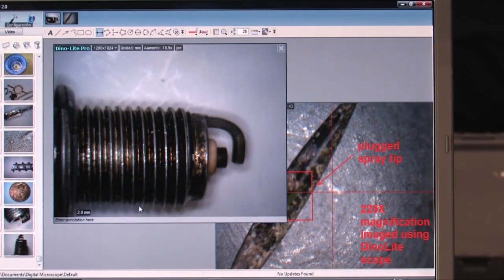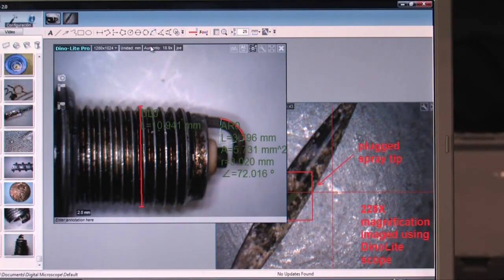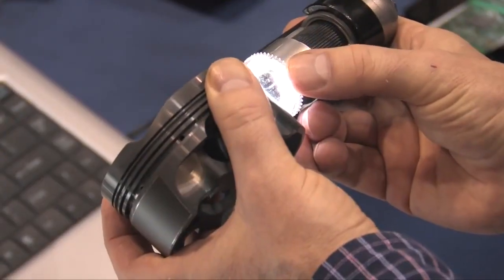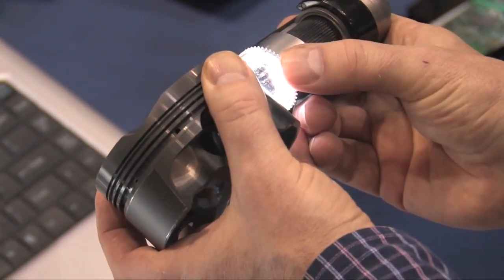Some of our scopes have a calibratable measurement feature as well. I could measure any two-dimensional aspect of the spark plug that I care to, and since it's calibratable we can demonstrate repeatability. We can keep a log and really see a progression of a feature we don't care for in our engine and have an idea of what's going on inside. It's great for detecting cracks, general surface inspection including paint finishes, welds — it's very good for welding inspection.